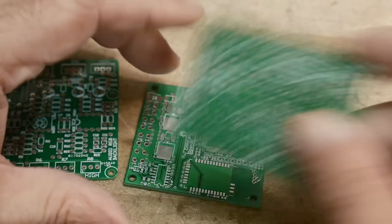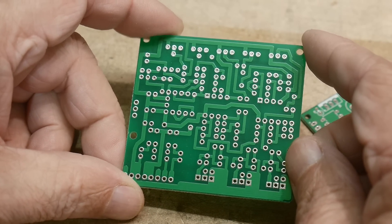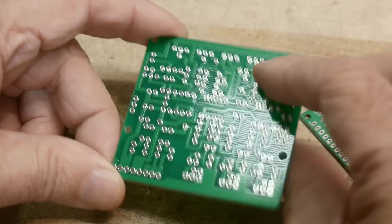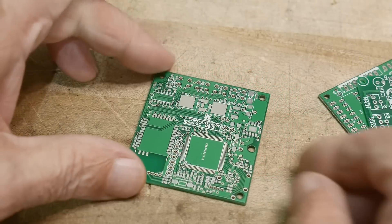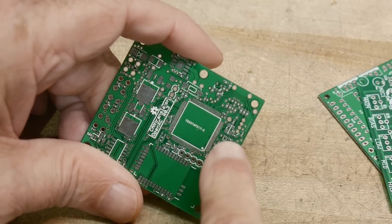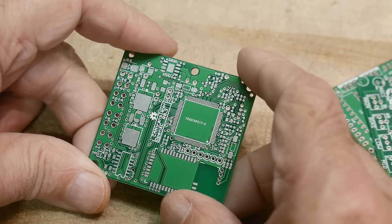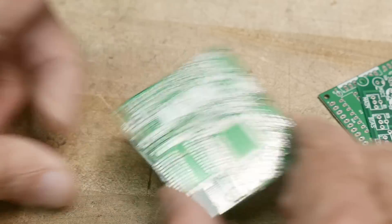Don't be afraid of a little bit thicker trace. Here's a board where I don't know what CAD package was used, but everything is right angles. A lot of people don't like this right-angle thing where everything is a square trace. But it's okay — nice fat lines on top, lots of letters and stuff, so that came out pretty good. Here's another board that's an example of lots and lots of little parts — everything is really jammed in there and there's very little nomenclature; there's just no room for it. If a pick-and-place robot was building this board, it doesn't care — it knows where things go. But it's very hard to troubleshoot this board because you wouldn't know what went where. Not a big fan of that board.